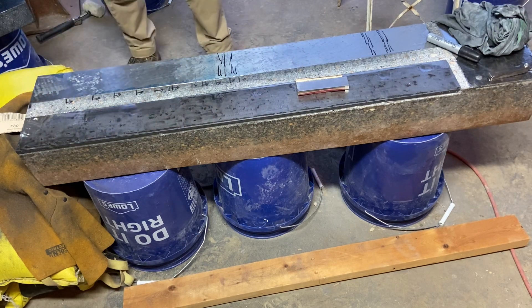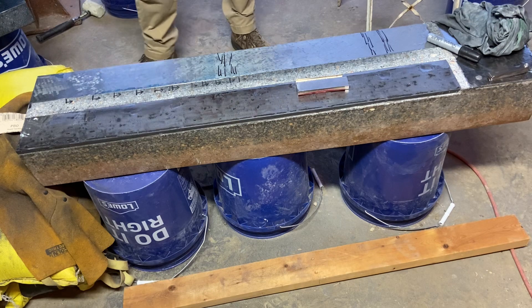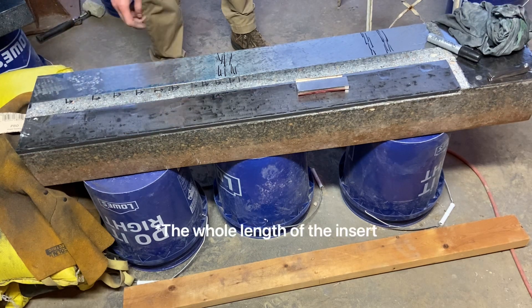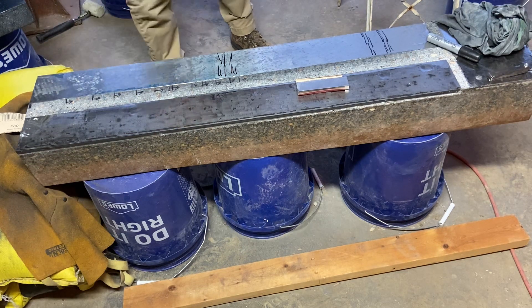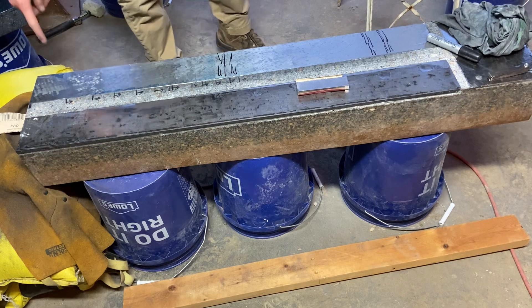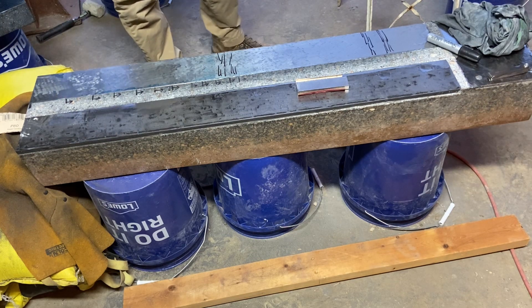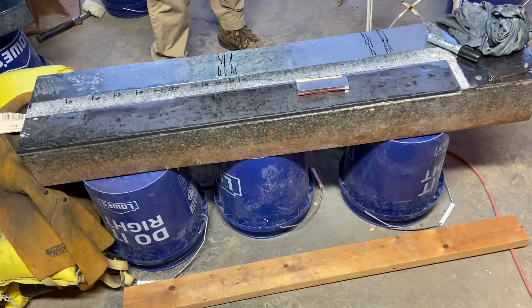I'm going to take this high spot down, probably doing a couple of passes in a row on that spot. At this point I've been sloping down this whole distance, so each section I've had to remove more material — I've probably got to remove at least 10 or 12 thou in that area, which will take forever, but it's coming along.